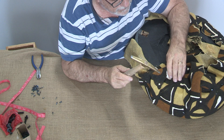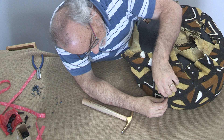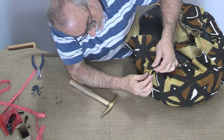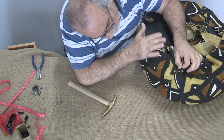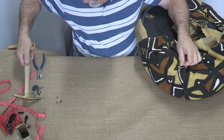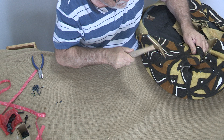We're going to pull our pleat here. This one's coming out a little short, so I'm going to pull that that way — instinctively I knew it was a little short, so you want them all the same length. When you're doing the folding process, you're holding this while at the same time pulling this, getting a tight pleat — the same size, the same distance, the same length — and with all this stretch working out the wrinkling. The nice thing about pin tacks is you're not committed: you can take one out and go back and fix it, whatever you need. It's not like you sank a tack all the way and have trouble getting it out.